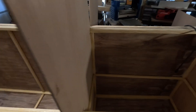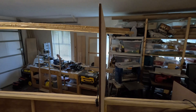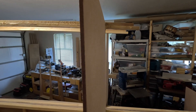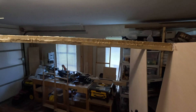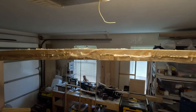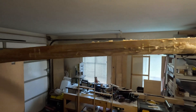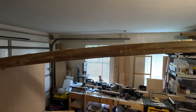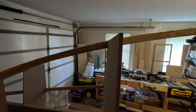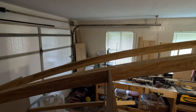For bulkhead number four I like the alignment quite well. Looking here, when we go to put the connecting piece across these two bulkheads I think they're going to line up quite well. I'm happy with how the alignment is on the cabin top — the two cabin top stringers — I was worried one was going to be significantly lower than the other, but it looks pretty good. Walking along, you can hear the build platform creaking. At bulkhead number two there's a bit more of a discrepancy.